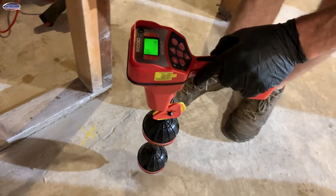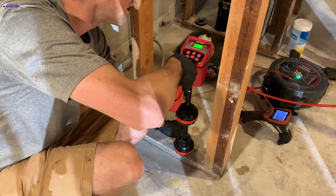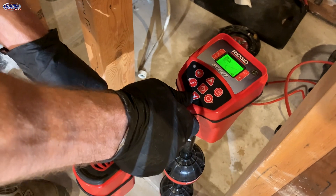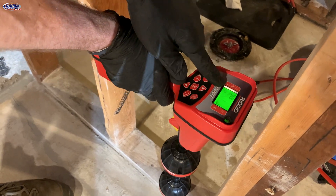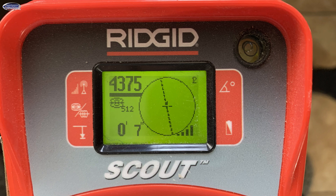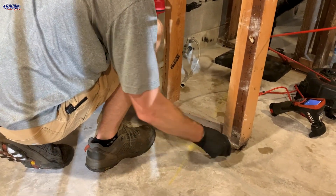It's going to be one side of it. Now I can't find the other one — looks like the other one's back here. So right between here and here is called the equator. I've got one ball over there, one ball there. I should be able to rotate this and get the depth. That's telling me to rotate right here. So 7 inches down from here is where we have the shower drain, coming in from over there. We know it goes from the toilet to here, and we're 7 inches down.